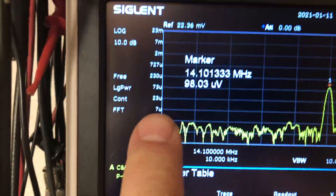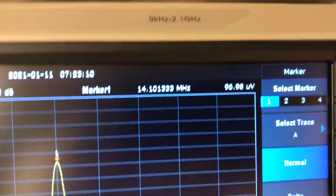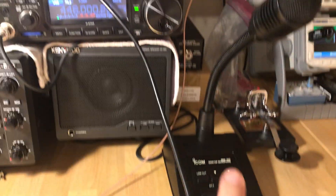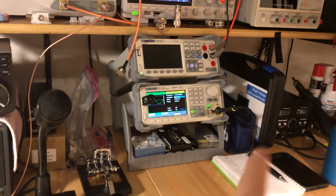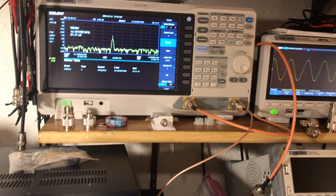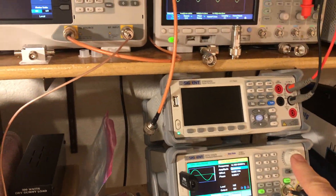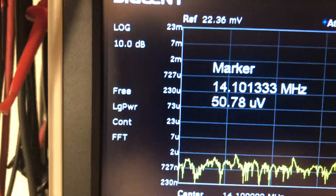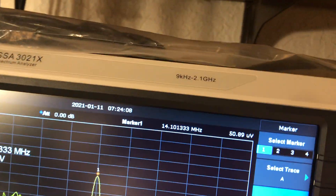As you can see, this goes straight up via coax to the spectrum analyzer, and it's reading about 98 microvolts — almost 100 microvolts — which is too high for 50. Before, we would set attenuation for 50 microvolts unloaded, then put the radio on and expect S9 — that was incorrect. You need to do it with the radio in line, because there's going to be loading and pulldown. So I have: signal source → scope probe → attenuation → BNC T-connector → radio antenna B input and spectrum analyzer.